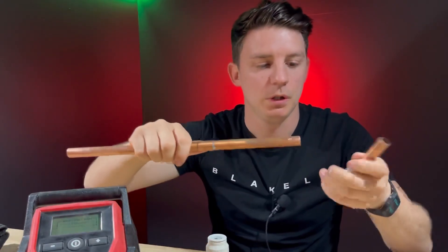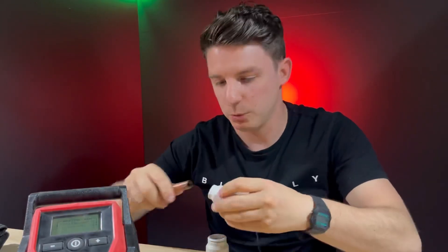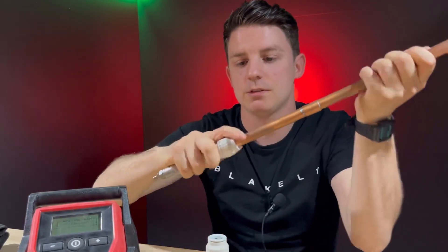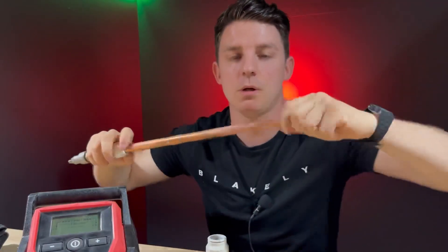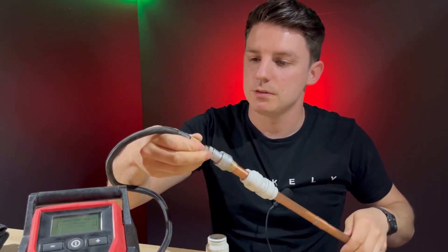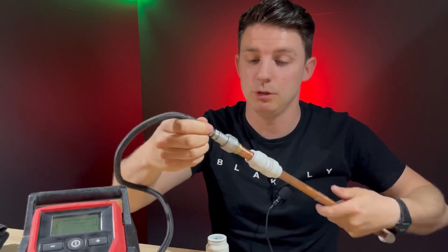So it's pretty easy. What I'm going to do is put a test on a bit of pipework right now for you. The speedfit socket goes on — this is the joint and the pipework that I'm going to test — just gets pushed on nice and easy. Speedfit cap end on the end, and then we basically just twist this connector on, just hand tight, that's all it really needs.